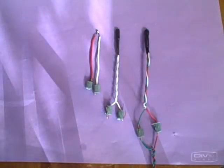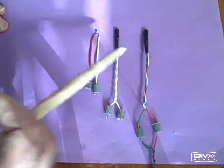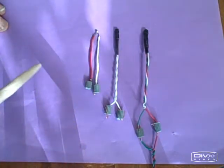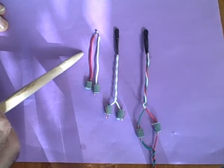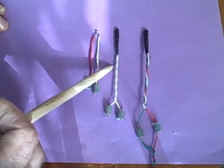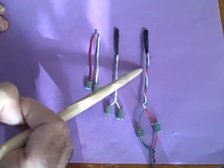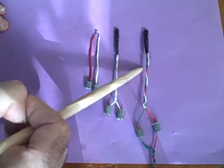These are three common remote temperature probes: the thermocouple, the thermistor, and the calibrated temperature probe. The thermocouple generates a voltage in response to temperature. The thermistor changes resistance in response to temperature, and the calibrated probe puts out a voltage in proportion to temperature.